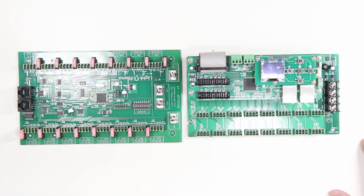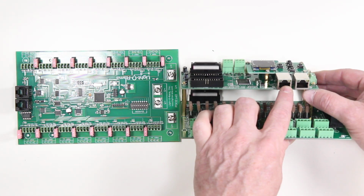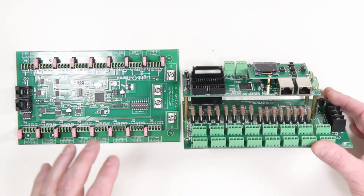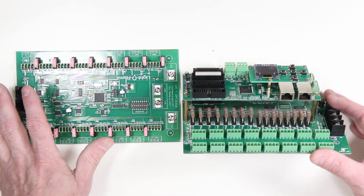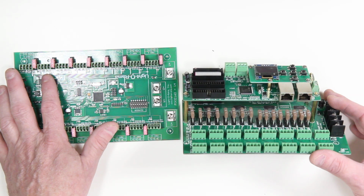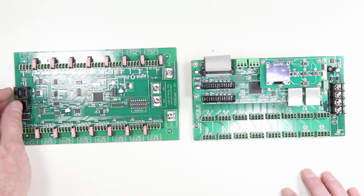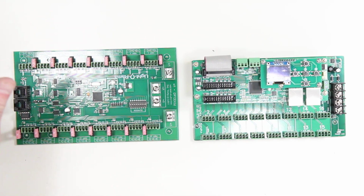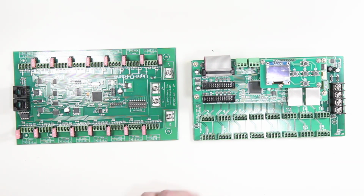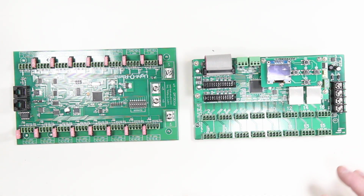So very low bandwidth. Now, on the AlphaPix, we have Ethernet. Ethernet is 100 megabits, so it's 99 times more capacity than the LOR unit. Also, we have longer distances, so even at that maximum output of around a megabit, you can only go short distances without having problems. With Ethernet, we can go 300 plus feet with no problems.